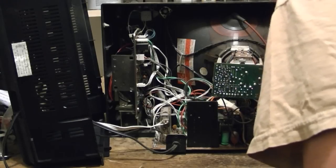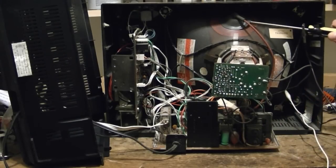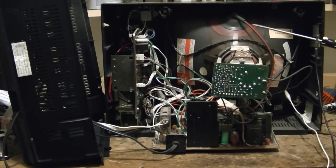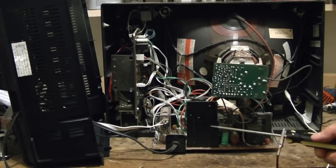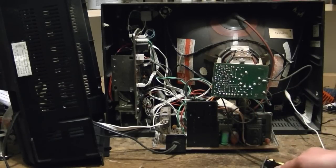This ground strap runs around the outside — and that's it. Now these can start building up a charge again after a few minutes; I forget the exact mechanism, but it won't be anywhere near as much as the initial charge. It's not a bad idea to do this a couple of times, especially for a larger color picture tube — the bigger the tube, the more charge it can build up due to greater surface area. If you're also concerned about the caps in the main power supply, you can discharge those with a screwdriver as well.